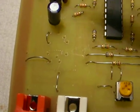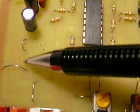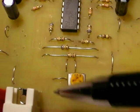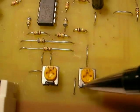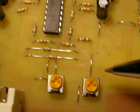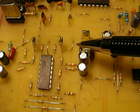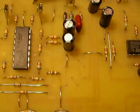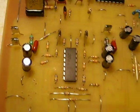Not enough light to focus. Jumper here, nothing in this hole, jumper here to ground, jumper here — make sure your jumpers are here, make sure all 3 jumpers are here. Also make sure the wires are soldered on the bottom of these pots — it's easy to miss them. Jumper here, jumper here, jumper here, jumper here, jumper here, jumper here, jumper here, jumper here, jumper there, jumper here, jumper back in here, jumper up here, jumper up there — that should do it. Thank you.